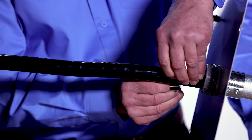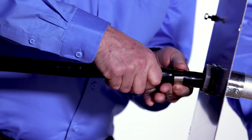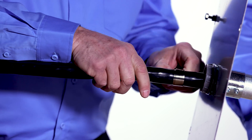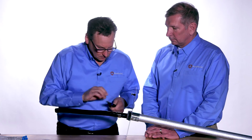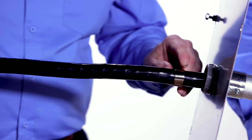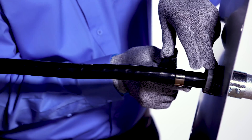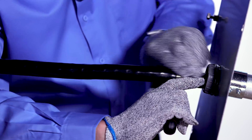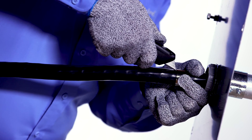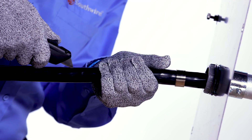The first step is to remove the outer jacket. It's good recommended practice to use the constant force spring provided in the kit as a straight edge to get a nice cut. You can align the spring with a pair of pliers. The jacket is removed with a utility knife — you'll make one ring cut, and then a longitudinal cut along the entire jacket length. Be careful not to go too deep and cut the tape shield underneath.